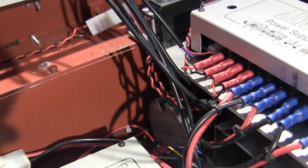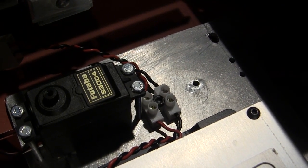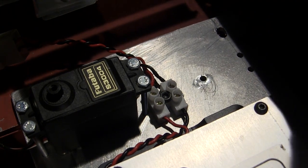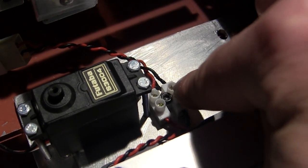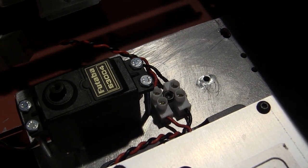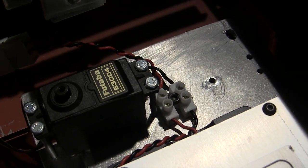With this terminal block, I can now power the other accessories like the lights, the fans, as well as the refueling pumps, which are going to be the topic of the next video. But with this setup here, no extra soldering is really required. I just run the wires to this location over here, loosen these screws, insert the appropriate wires to their locations, and then just tighten them down. It's a very simple way to add more functions, and it also cuts down on the amount of soldering you are going to have to utilize when building a model like this.